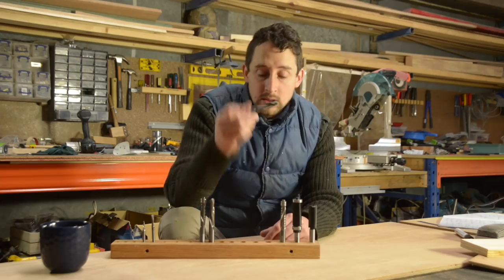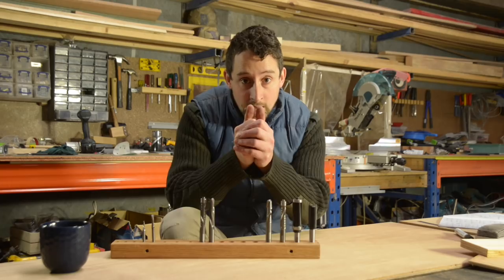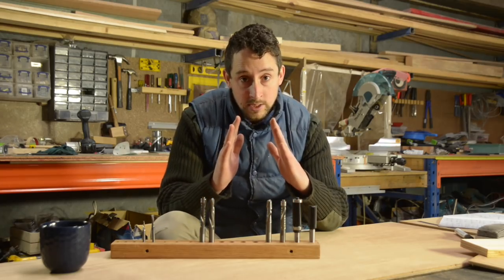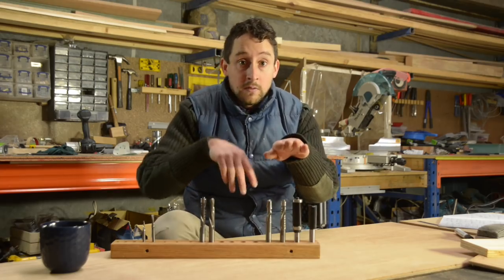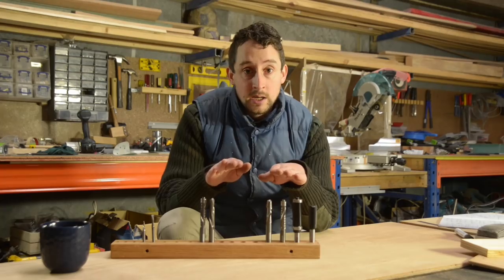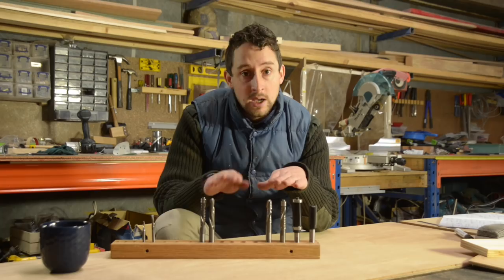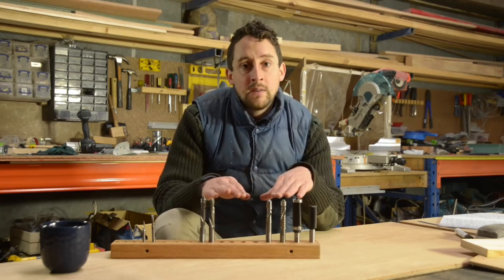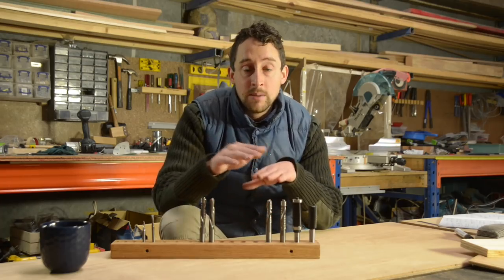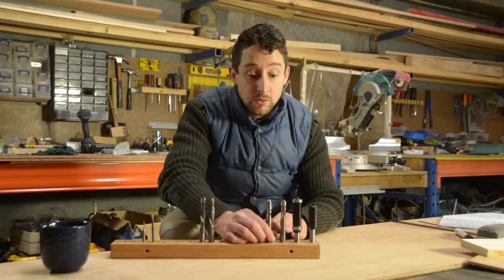One thing to consider though: if the bit is cutting through the timber and the chips are flying out at high speed, it also has a tendency to slightly feather those edges. If you're cutting a trench or a little channel in a nice good-quality solid hardwood, that usually won't cause any tear out — but it is something to keep in mind. One thing I've done before is put just a really thin layer of something like packing tape over the place where I'm going to be cutting that trench, and that prevents any tear out and works really well.